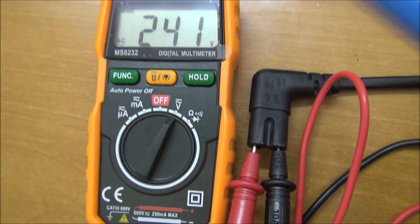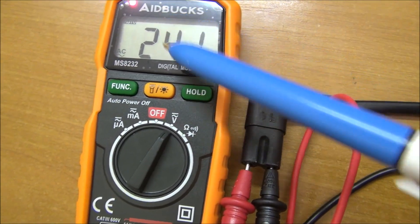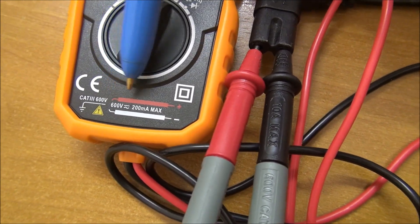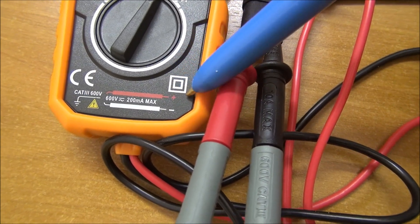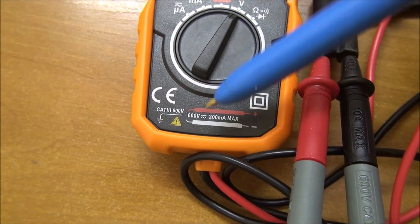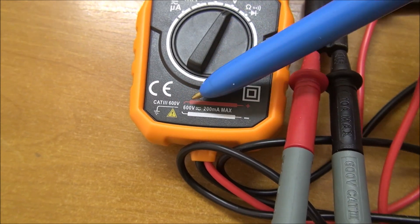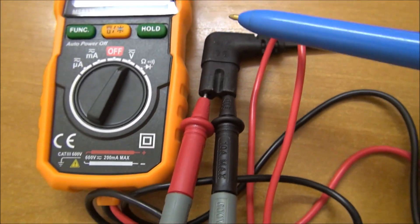As you can see here, this multimeter is perfectly able to read the mains voltage, but it has its limits. Don't forget not to exceed the limit, which can damage the device and potentially harm you. This device is not an industrial meter, even if you can see here the double isolation symbol on the device. Normally, we can reach the DC voltage here, but for more safety, just keep in mind that you should never measure a voltage over the mains value.